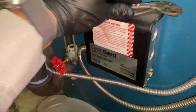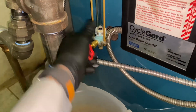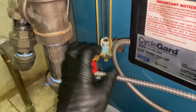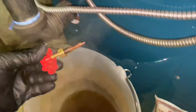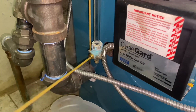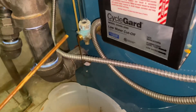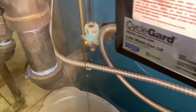I'm going to loosen up that nut and take out the bottom valve. I drained a lot of the water so we won't have anything come out of there. I'll rinse that off. Now I'm going to take one of the rods to protect the sight glass and shove it in there — look at the crud coming out. See how it's draining much better now? Let's add some more water.